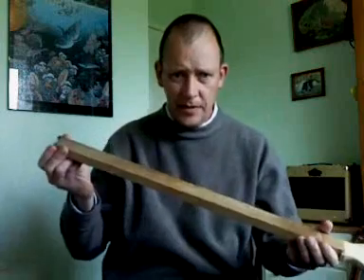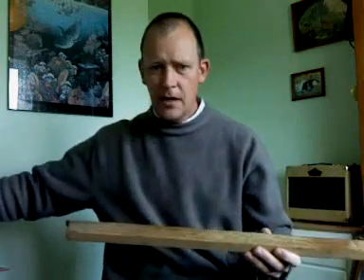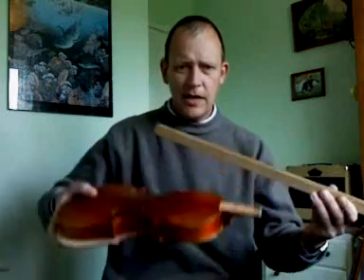The next thing is to taper the neck down a bit so that it's a tapered neck, which looks better on a violin. And of course to try and get some sort of scarf joint to get the angles right, because that's the tricky bit with a violin - getting the angle on the neck correct for the body and getting the bridge in the right place. Violins make archtop Gibsons look quite flat. Smaller violins are probably easier because there's less curve in them. But we'll see how it goes.